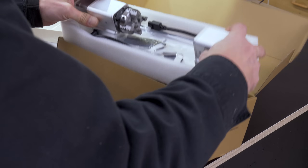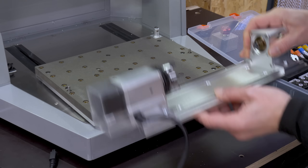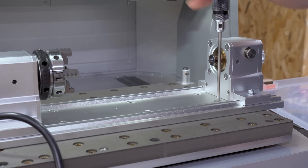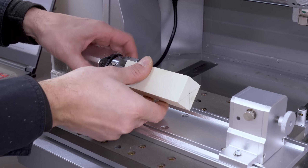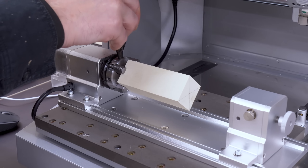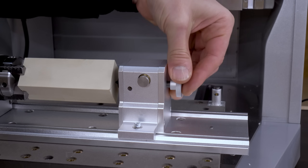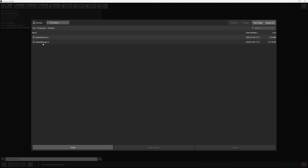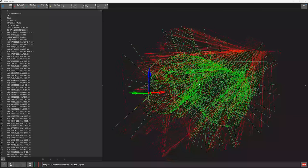It's time to try out the fourth-axis chuck by doing another example. It's easy to install by using two alignment pins and some screws to secure it to the bed of the CNC. Now I have to hold the resin piece included in this kit with the chuck and align the tailstock. Just like with the previous examples, I only have to follow the instructions in the handbooks and the CNC controller to cut a 3D model.